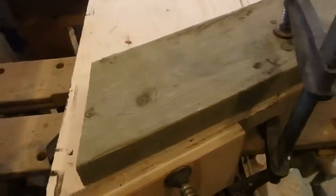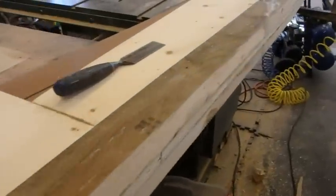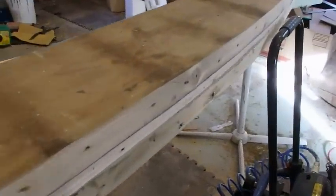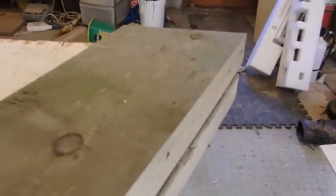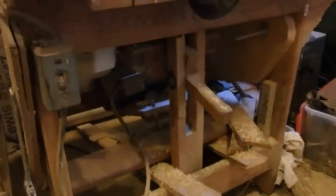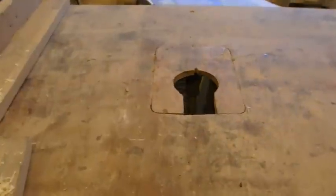So you may have an eighth of an inch here or there to trim off. I'm well aligned throughout — it's all trimmed and it didn't take too long using the power planer. The curves along here I still have a little bit to clean up, but the alignment's good. I had to take just an eighth off the top bow frame to get it to align. This table saw I designed and built myself and have worked off of for about 20 years. The motor runs both the table saw and an arbor underneath that pivots up for a shaper, and there's a router table on the end.